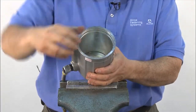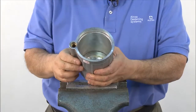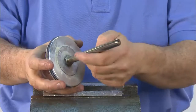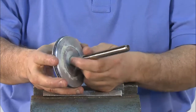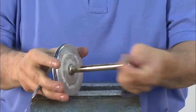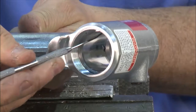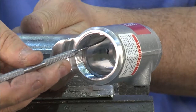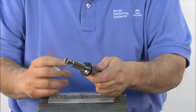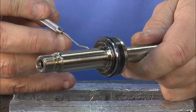This is a good time to inspect the inner workings of the 2025 tool. First, inspect the cylinder for scratches — if present, clean them up or replace the whole cylinder. Inspect the piston rod for visible scratches that you can feel with your hand or with a scribe. Also, inspect the handle and interior cylinder bore, looking for scratches and anything you can feel with a scribe. Finally, inspect the pull piston for scores and scratching on the surface area.